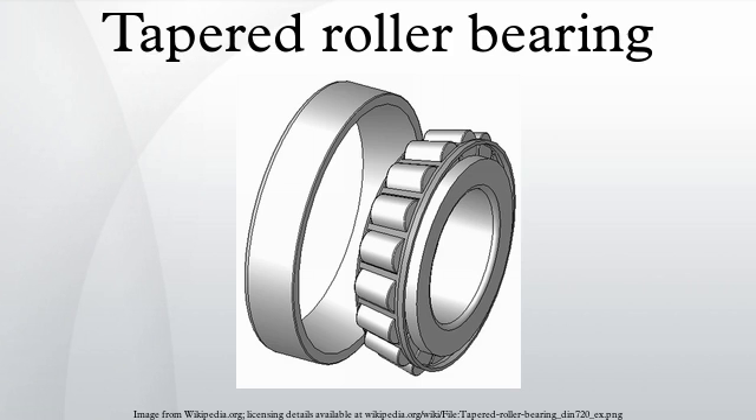Tapered roller bearings were a breakthrough at the end of the 19th century because bearings used in wheel axles had not changed much since ancient times. They consisted of a cylindrical seat on the frame and part of the axle enclosed in a case or box that held a lubricant. These were called journal bearings and relied on the lubricant to form a fluid bearing. Without adequate lubrication, journal bearings would fail due to the excessive heat caused by friction. Timken was able to significantly reduce the friction on his axle bearings by adding tapered elements which actually rolled while transferring the load evenly from axle to frame through the hardened steel inner and outer rings and the rollers — his tapered roller bearing.